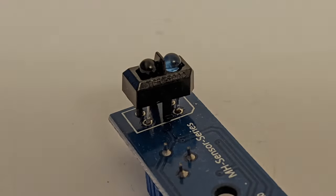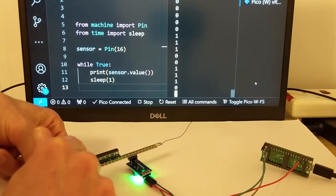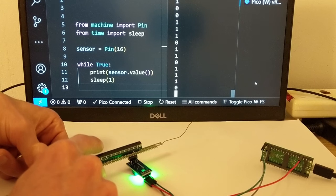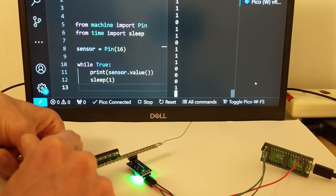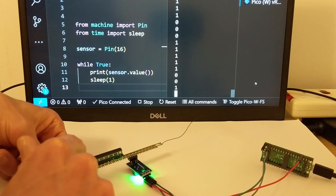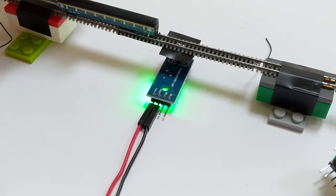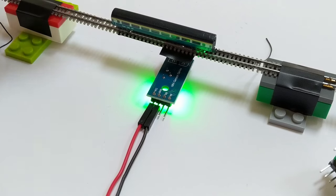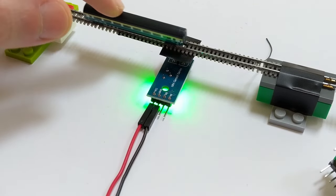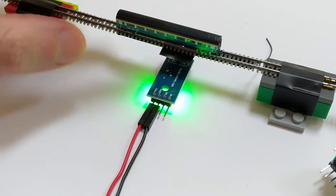Finally, to automatic train detection. I bought some infrared detector modules to use with a Raspberry Pi Pico. These have a little divider between an infrared bulb and a sensor. It was a bit fiddly to hold everything in position correctly, but by having the bulb below the gap between one pair of sleepers and the sensor beneath the next gap, it was able to detect the presence of a carriage. The module has an LED to indicate it's got power, and another that lights when it's detected something. I also had a short MicroPython program on the laptop showing the digital output from the sensor. On another day I covered surrounding sleeper gaps, leaving just two adjacent gaps — that still works. The Raspberry Pi Pico with headers already attached was £4.80, and a pack of five infrared sensors was £5.79, so it's a low-cost solution. I've put links in the description.